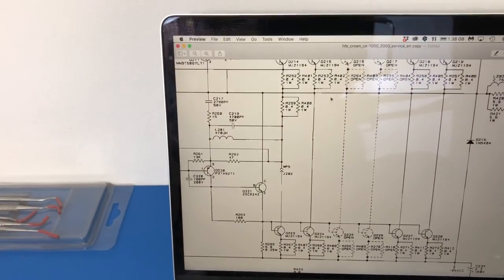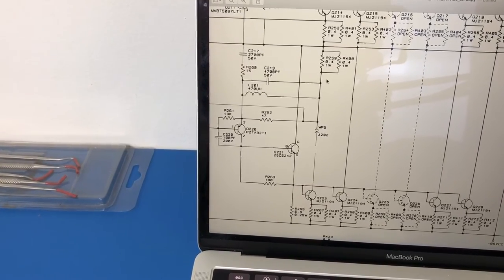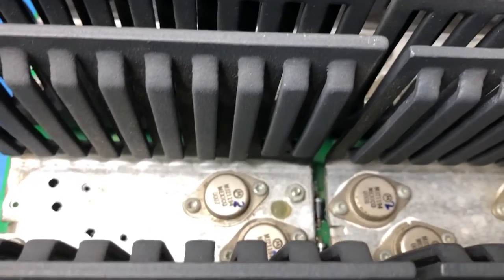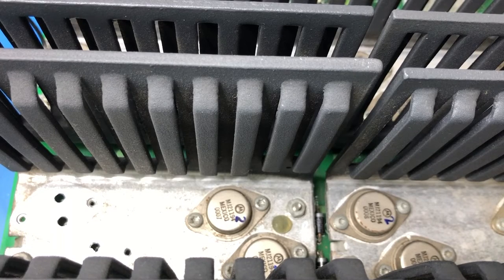So their collectors are joined all up here. But that one, Q223, which is the dead one, goes through these two resistors. So it's been a real pain to multimeter these out because there's so much scunge on the actual metal. This is just where it's collected all the dust. So it's really, really hard to get a stable reading. And this is one of the things about high impedance input on a multimeter that you've got to keep in mind, is that sometimes it'll show you essentially what looks like an open if you're not careful. But by the time you put a bit of power through it, it isn't open at all. So especially in high voltage, high power, high current situations, that can be an issue for determining whether something is actually connected together or not.